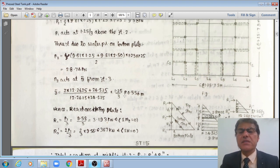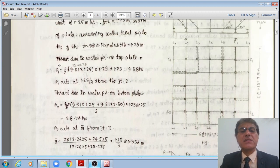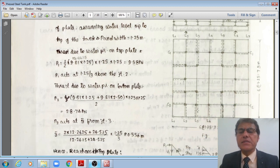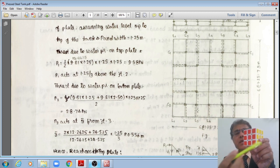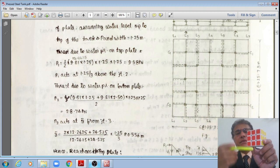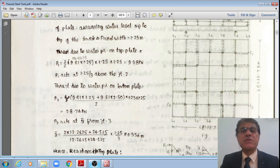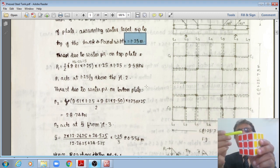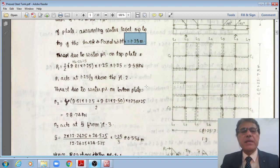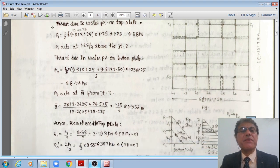Let's first calculate this hydrostatic force, the thrust. We can see that the stays are provided at every 1.25 meter, student. Therefore, the panel width for the design of the stays is 1.25 meter. And the height of each of these plates is also 1.25 meter. Therefore, the thrust due to water pressure on the top plates, this capital P1, is